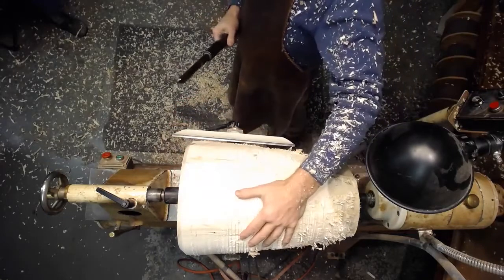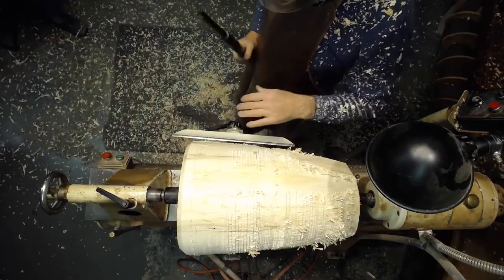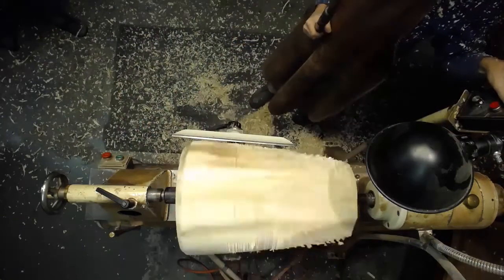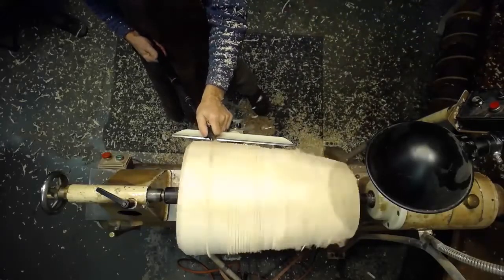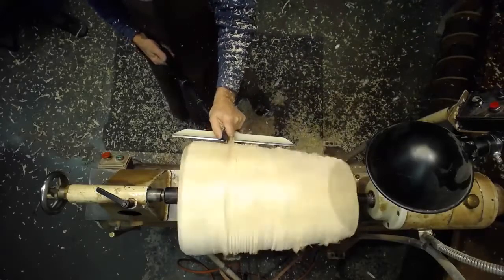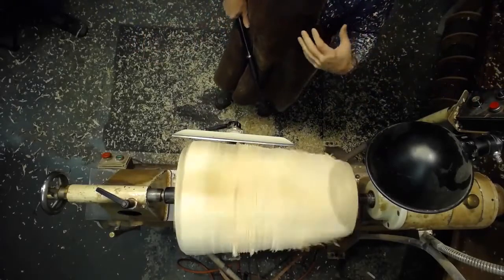So in this case, I saw some of these big holes and I actually cut off a few inches on the end. There are other times when I'll use a chainsaw and see right away that it's got a defect I don't want to work with, a big knot or something. So that's the main reason I'm chainsawing off the corners of the log, just to get some knowledge of what's in the wood before I bother to bring it into the shop.